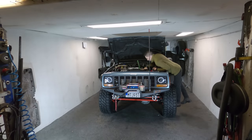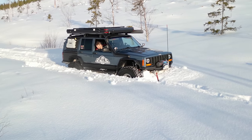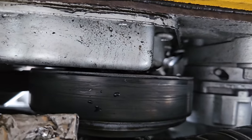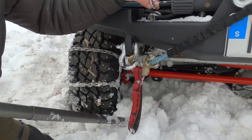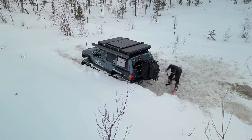I'm back in the workshop fixing some issues that occurred as a result of my last outing. Dense snow drifts packed under the engine bay, pushing my diesel heater ducting into the harmonic balancer, which unfortunately burnt a hole in the ducting. I also broke a front U-joint on the front chromoly shaft, which stranded me in some tough snow conditions. One of the worst storms in the last 25 years hit that evening, which did reassure me that my DIY load bars are not going anywhere.